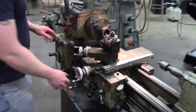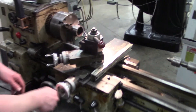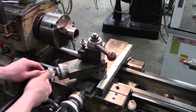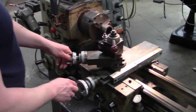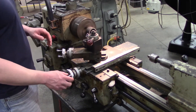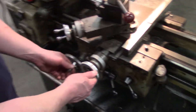There are three wheels here. The big wheel moves toward the chuck and away from the chuck. The medium-sized wheel goes horizontally across the chuck. What you're going to use for the bevel is this angle here — it's roughly 35 degrees, which gives you enough room to get a TIG weld in. It moves like this and just gives you your angle. The first process you're going to do is facing it, using these two handles. That turns the machine on and gets it spinning. First thing is to face it — put a flat spot on the pipe — using the medium-sized and big-handled wheel in the first operation.